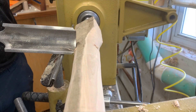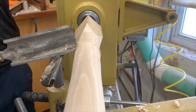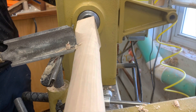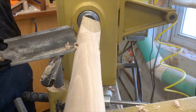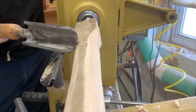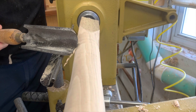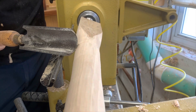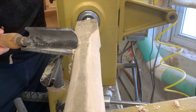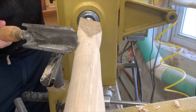If I'm scraping, it's not cutting the wood cleanly. But if I rub the bevel, I get nicer slices. I always recommend turning the lathe off and spinning it by hand so you can see what's going on. When I change the cutting angle you can see these nice curls come off — I'm still rubbing the bevel but I've just changed the cutting angle. Instead of approaching at 90 degrees, I'm approaching at 45 degrees.